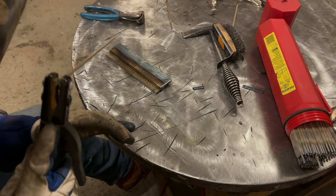The profile of this is a little bit flatter, I guess, than the other side. Had a little rough of time on the restart there. Again, with 6013, this is pretty decently acceptable. I'd like to improve that and that, but not bad for where we're at. I definitely prefer to run 1/8 inch rods on this. It's a lot easier overall.